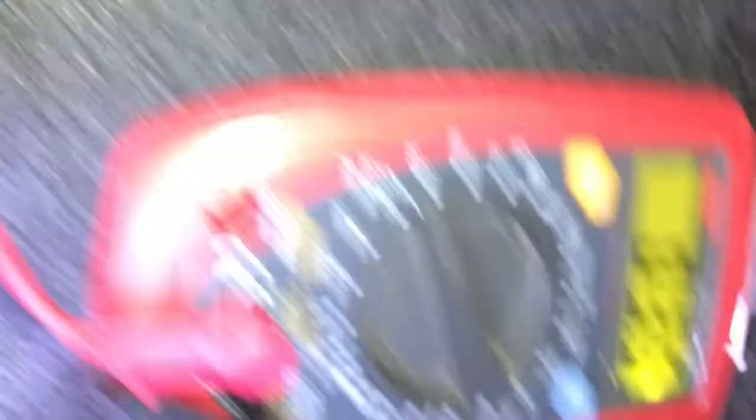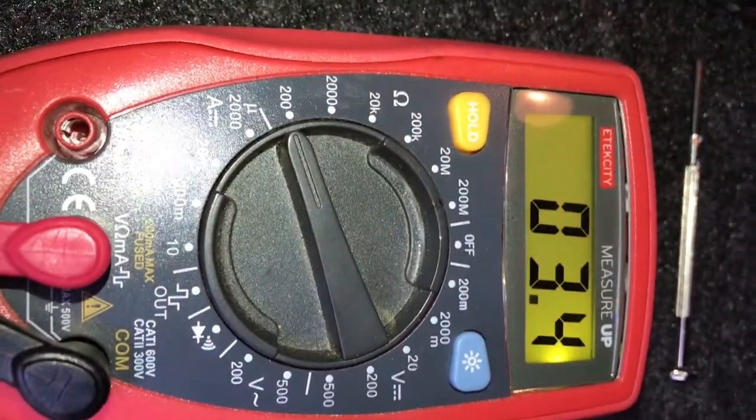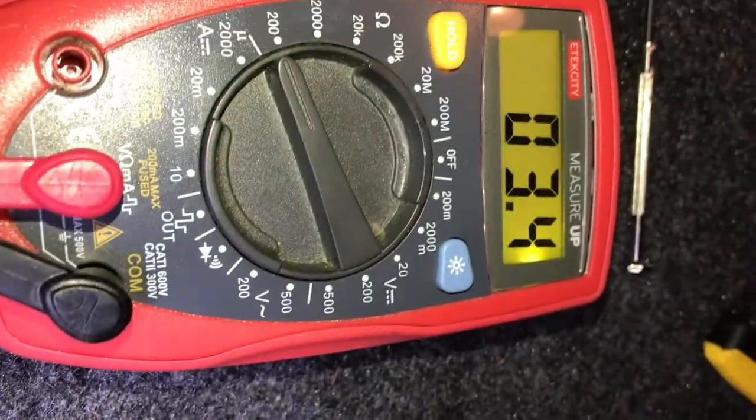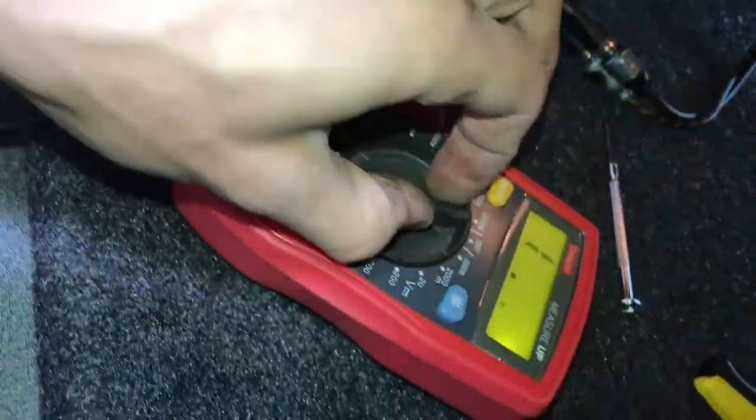Positive to positive — like that. I'll come over here. At 3.5 — it's supposed to be a 4-ohm load, reading 3.4. And the other one is also 3.4. So it shows they're working because they're not broken speakers. That's probably something I should have done before I even put them in the box. So if you do something like this, make sure you definitely test the resistance ahead of time.